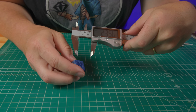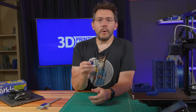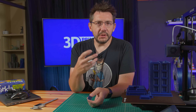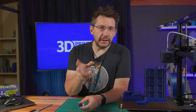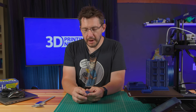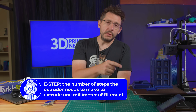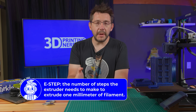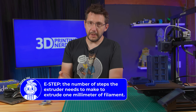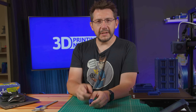Okay, now Z — and we're at 19.96. X and Y were both above 20 millimeters, just by a little bit. During the live stream Chuck was in the chat and told us a suggestion that makes a lot of sense: we have bulging on the corners, and that can be because the e-steps aren't correct. One of the next steps I want to do is check and adjust the e-steps to make sure if I'm extruding 100 millimeters of filament I'm actually extruding 100 millimeters. That could be why X and Y aren't closer to 20 — just because of the bulging corners.